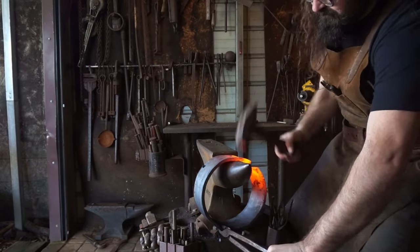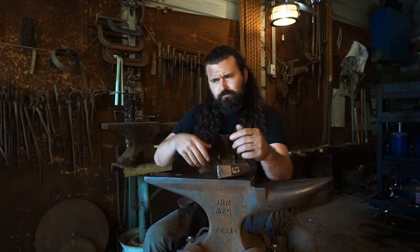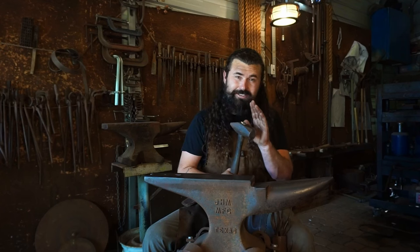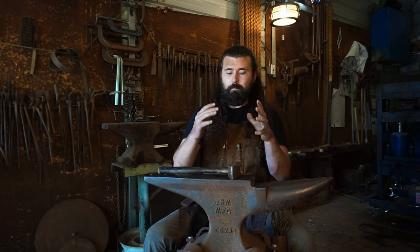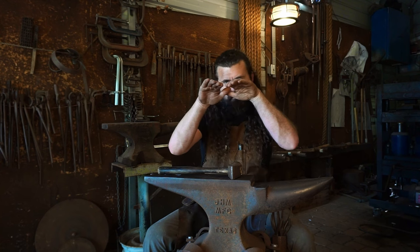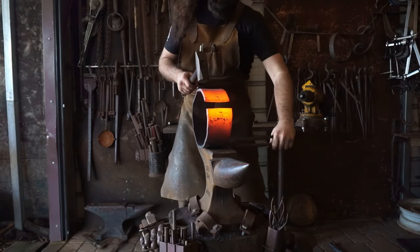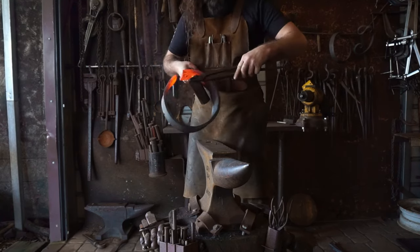When you're forging big bar like that, I use a four-pound hammer for the most part. What's interesting is when I'm forging the rings over the horn of the anvil, you'd be shocked at how light I'm actually tapping. It might seem like I'm really giving a lot, but it's incredible how delicate this art form really is — you're just feathering this perfect, perfect circle. Because if you think about a circle, it's the shape of infinite edges, so as you're working your way down, you want as many points of contact as you possibly can.